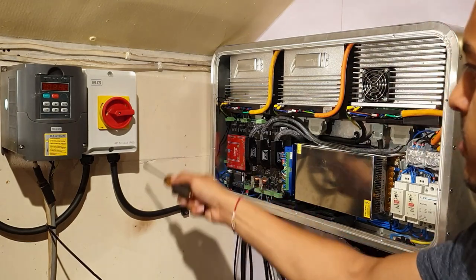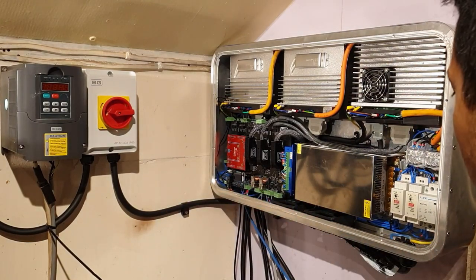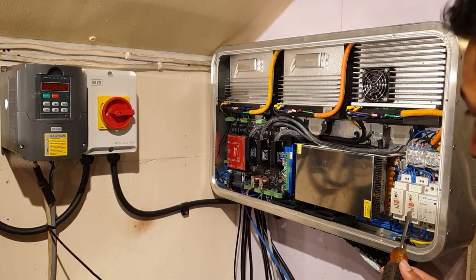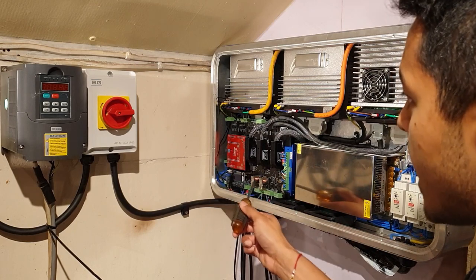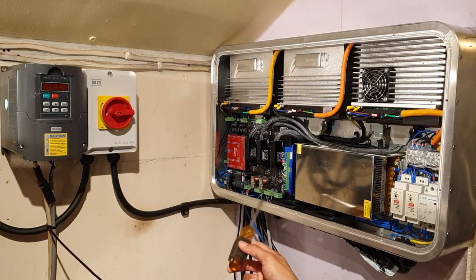So the idea is that comes through and then runs into my actual enclosure itself. So I've got the power coming in over here, and then it's distributed to my actual 5 volts and 24 volts power sources, and they supply power to my breakout board, and then also my temperature controller, which controls these fans, which are over here.